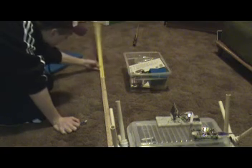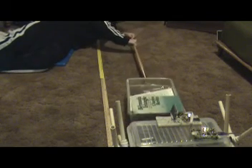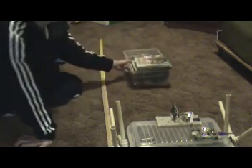Finally I'm going to send smaller objects at it and see at what height the robot starts detecting the objects. I found out that it's about between 7.5 and 8 inches with the current sensor position when it will start reading that signal.